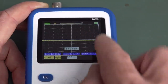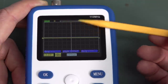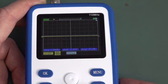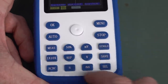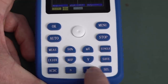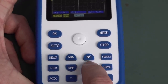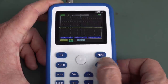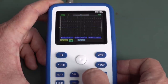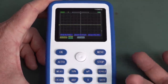It looks like, yeah, no, we aren't seeing anything beyond the window. Why even have that at all if there's going to be nothing beyond the window anyway, maybe at different time bases. But anyway, seconds, nanoseconds, the layout here. Oh yeah, I guess that makes sense, having them in that direction, because that changes your X, and this changes your Y, millivolts. This is the times one probe, so 10, 5, 2, 1, it's got the 125. Oh, I heard a relay click. I'm sure I did. 20 millivolts minimum range, but for a little pocket scope, that's fine.